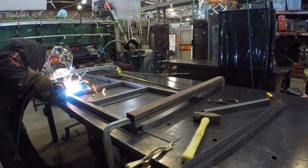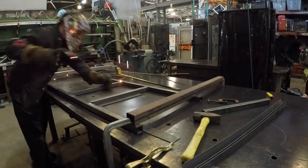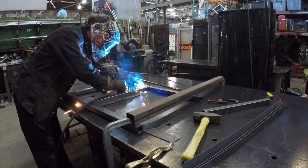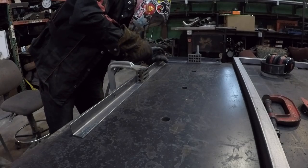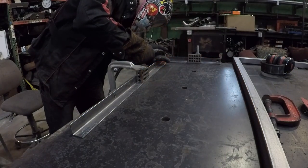Now we're laying great big caterpillars across the joints. All these welds are going to be ground down, so having the welder set up just a tiny bit cold helps it sit proud and prevent undercut on the weld edges. It means the welds aren't full thickness or full penetration, but it's holding up hoodies.